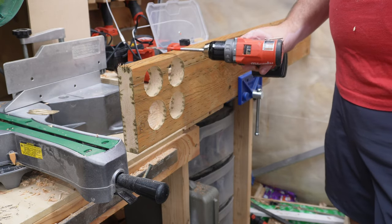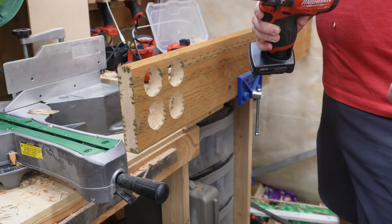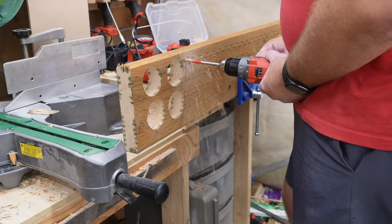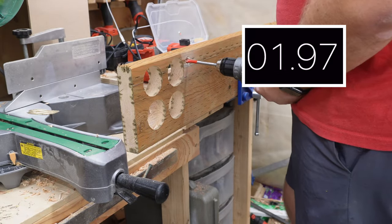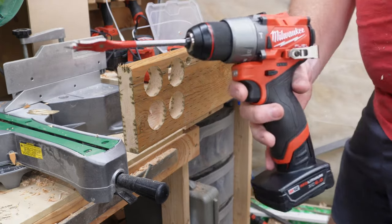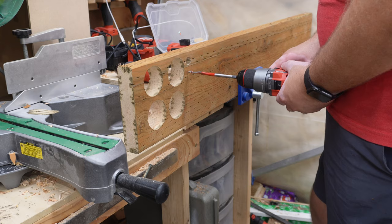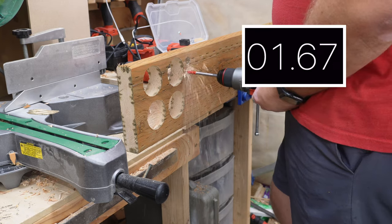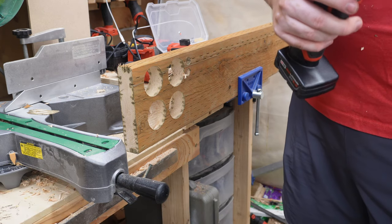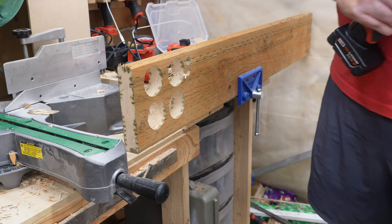We are drilling into pressure treated 2x8 lumber. Starting with a 3/4 inch Diablo Speed Demon, back up into Speed 2 with the Gen 2. It did go through, but we did cut out twice. Now with the Gen 3 — still full bars, in Speed 2, drill mode. That extra power in this tool is proving to be the difference. The lower speed doesn't seem to matter because it has the power to get jobs done where the other one is cutting out.